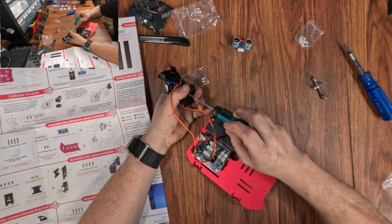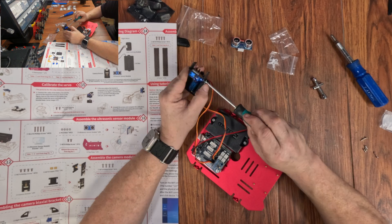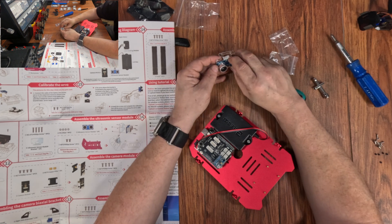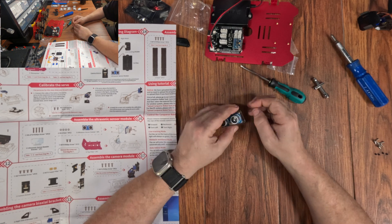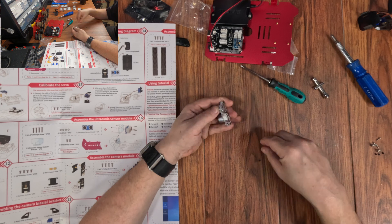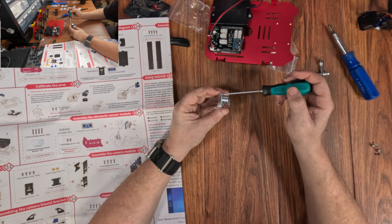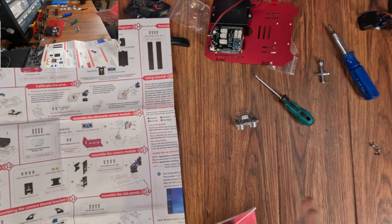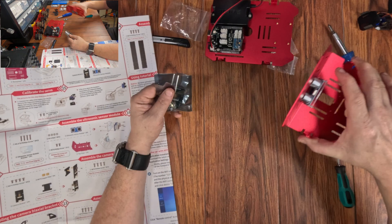What I was doing with it powered up is making sure the motor was 100% calibrated — they recommend this in the instructions. It's just making sure the motor is all the way to one side. We can skip step 14 and move right on to step 16: the ultrasonic sensor. This mounts to a plastic plate with four nuts and bolts, then that plate mounts to the top plate with two screws. The ultrasonic sensor works kind of like the line tracking sensor except it uses sound — a wave shoots out of the transmitter, bounces back, and is picked up by the receiver, so the Arduino knows how far away an object is.